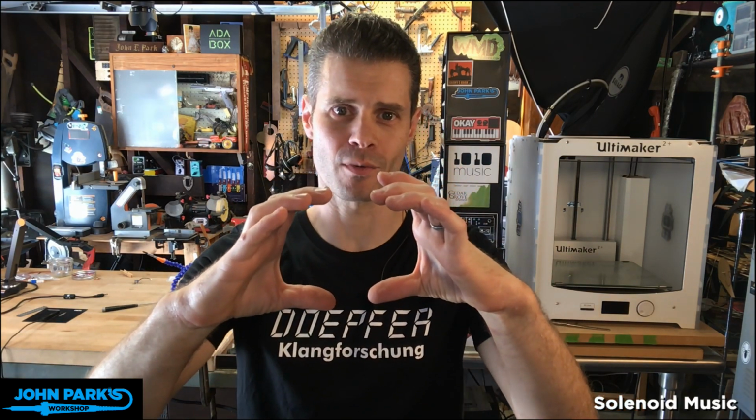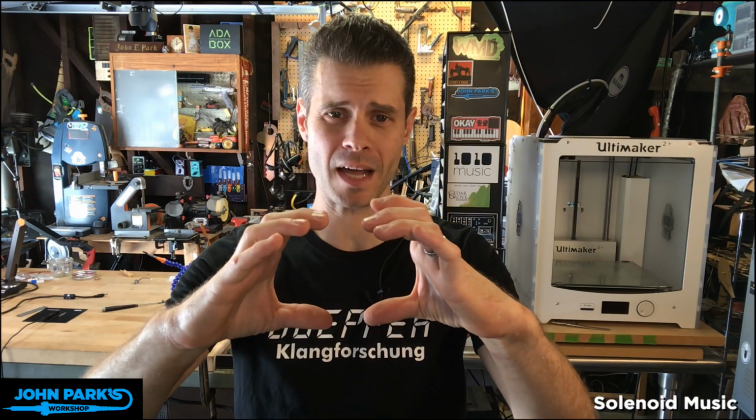And it's hot today, so I have a couple of fans going. One of them is just for my camera. I put a 120 millimeter case fan from an old PC of mine, pointed it right at the back of the camera. This is the one that's been overheating sometimes. I found out there's a firmware update that may also help with some overheating management stuff. We'll see if that helps. And I also opened up the battery door. This is another tip. I found one of those YouTube videos of 10 tips for how to keep your Sony Alpha 6300 from overheating when you're shooting video. So then I got another fan that's blowing air into the workshop.